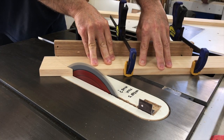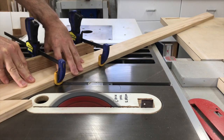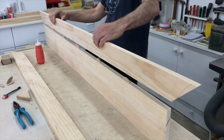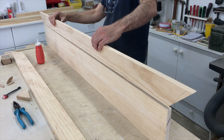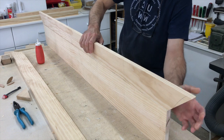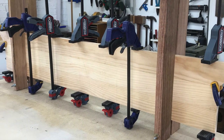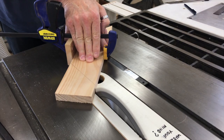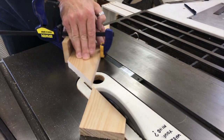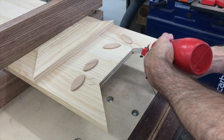While they were drying I cut the mitre on one end of the two outside boards and then cut them to length with the second mitre at the other end. I glued on one board at a time so I could get the placement millimetre perfect. To finish the top I cut the two shorter mitre pieces for each end and then glued them in place with biscuits and plenty of glue.